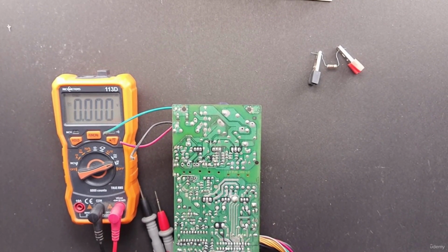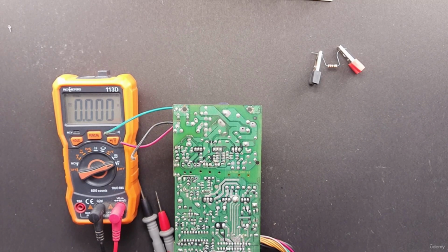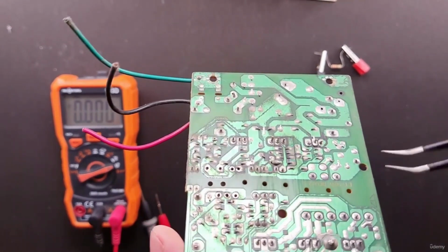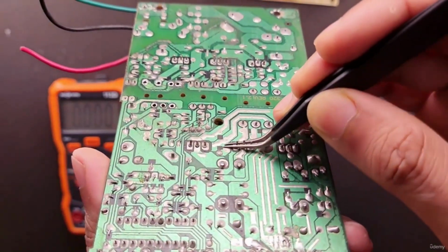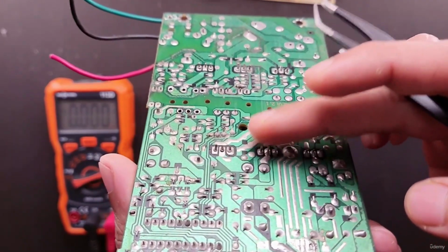The outsides of products are carefully designed to be user safe, but not the insides. It's easy to get sliced by component leads sticking up from the solder joints, or by the edges of metal shields or the chassis, and even by plastic parts, leading to cuts and bleeding. In this case, you can see these are the component leads which are sticking out. These are pretty sharp and can cut your finger if you are not careful.